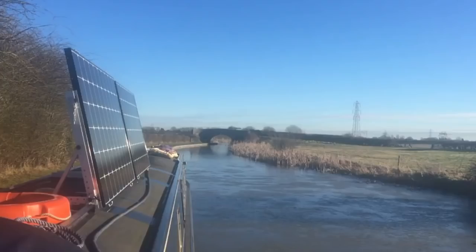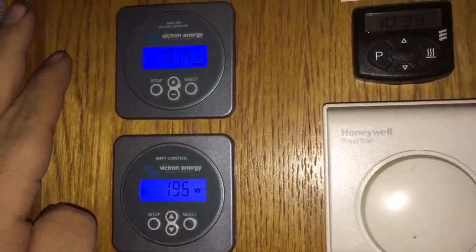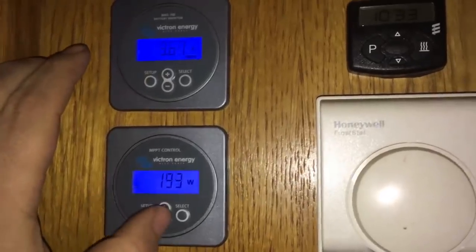Our last morning we were able to fully tilt because we were on the right side and the amount of amps we were getting was just amazing. It was a sunny day, no clouds, winter sun very low on the horizon — that's the point where it's most of a problem. When your panels are flat and the sun is that low, most of the photons bounce off the glass. They have to actually hit the glass and penetrate sufficiently to hit the cell to generate power, and we were still getting a decent amount of amps.